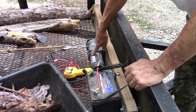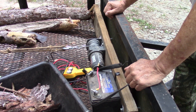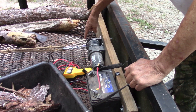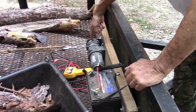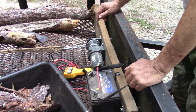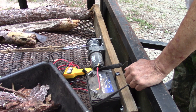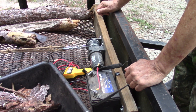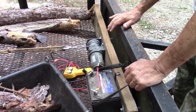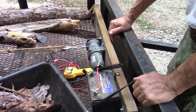This is a Badlands 2000 winch from Harbor Freight, for those who haven't seen the previous videos. When you're pulling at an angle, there's something to watch — the cable here does not run on this side of the spool. That's the reason I'm back here with gloves, sort of guiding the cable back and forth. It's much easier to pull if you're pulling straight than if you're trying to pull off at an angle like I started with. But with those cautions, the little unit does very well. The trailer will pull behind my golf cart fairly easily, so long as I don't really load it to the gills, and yeah, we can get some real work done with this outfit.